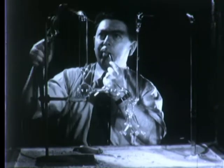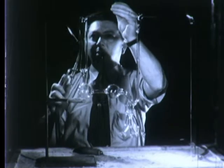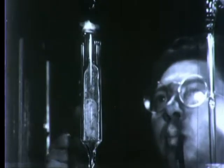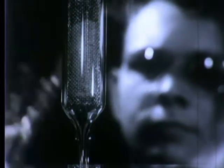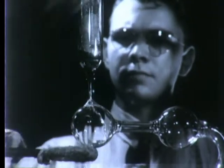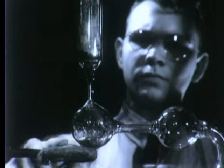In the new technique for putting sodium into the lamps, the metal is triple distilled to remove impurities, using an air-free system made of glass in which a high vacuum is maintained. From a wire mesh container in distilling chamber number one, the sodium undergoes its first heating. Leaving some impurities behind as slag, it passes down into a second chamber where it forms a silvery mass.